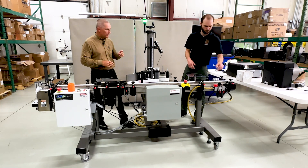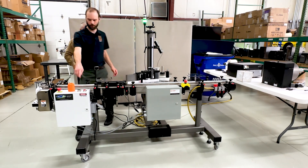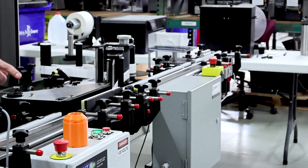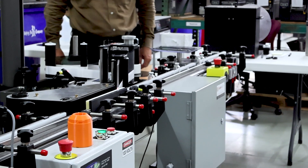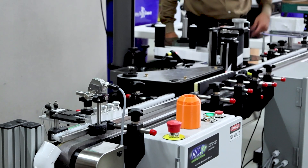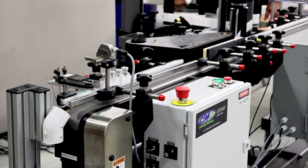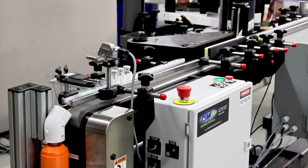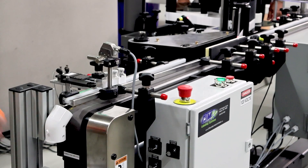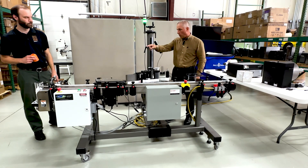I'm going to hand this back to Jake, and he's going to run this and spin some labels on. Come on over — I'll turn the conveyor on. We've already got a few vials loaded up there, so they'll come through and singulate. They'll stop down here, and then we'll sit a safe in there. Super fast, super quiet. I love the really slow-turning wheel here that builds the gap in. They'll sit there until the operator puts a safe in place, drops one in, removes the safe, and the next one is in the queue — just repeat that until they're done.